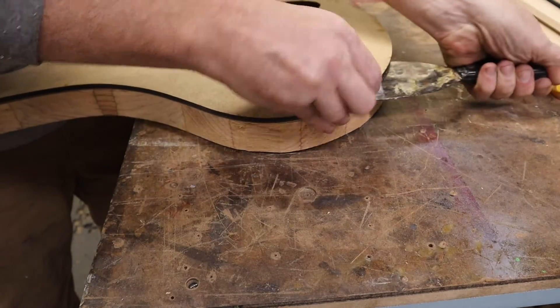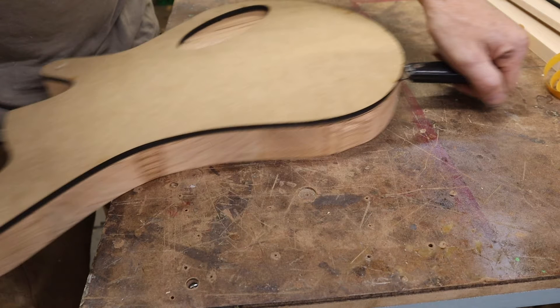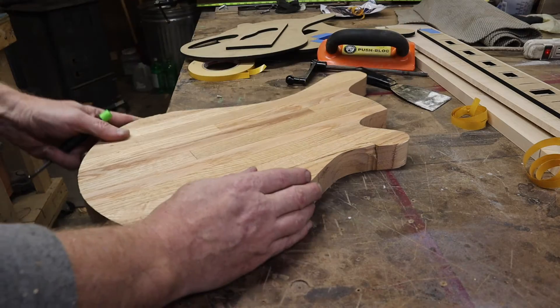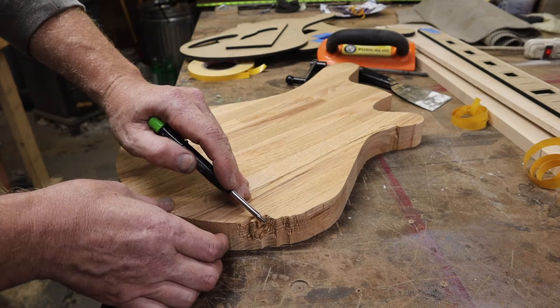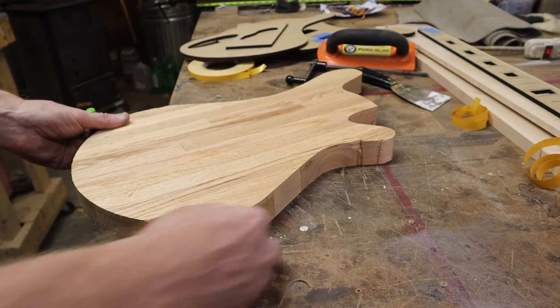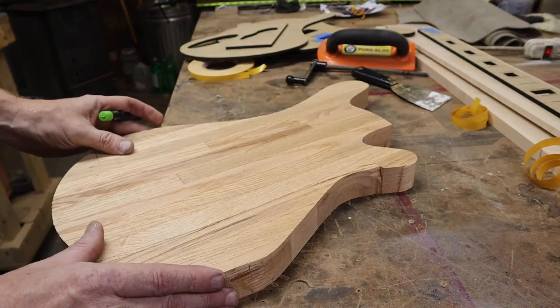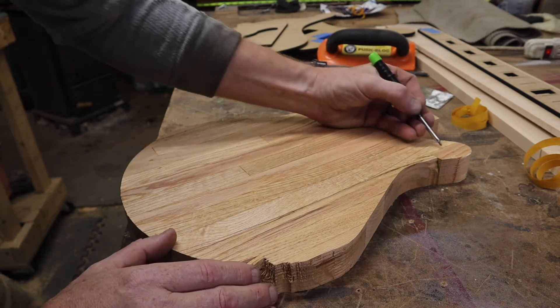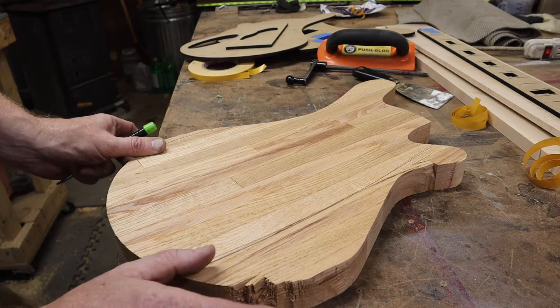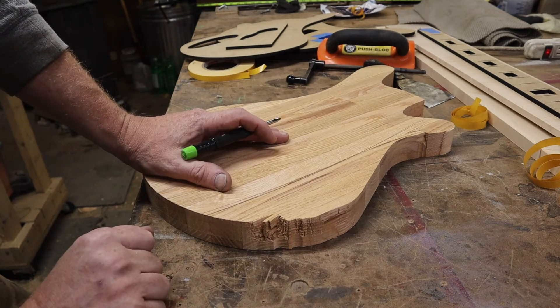You need to be very, very careful removing these templates because you can break them — they're only a quarter-inch MDF. I always suggest that you don't use the templates you buy from me directly; use those templates to make new templates. Because things can go wrong easily, and if you break the template you created, you still have the masters to go back to instead of having to buy a new set. We had a little bit of tearout here, partly because I lost control and let it slip, making a boogery mess of that. And there's a chip out because these are spots where the grain tends to want to chip when you're routing like that. What I could do is cut this wood off, grab some cutoffs, and glue a new piece on — it's all butcher block, it would look normal. But instead I'm going to do a little epoxy fill and have some fun with it. I'm kind of glad this happened because it will be interesting to see this problem-solving in the video.